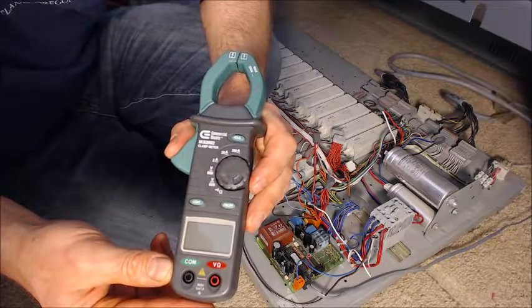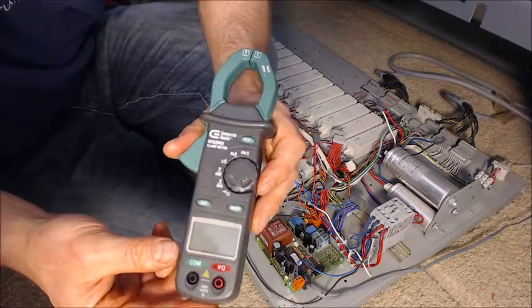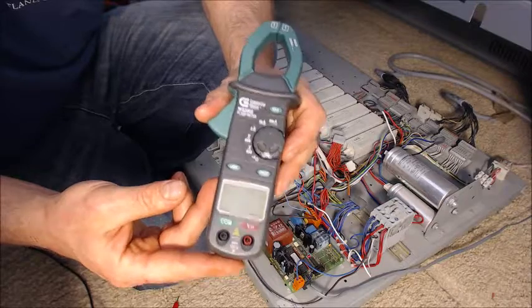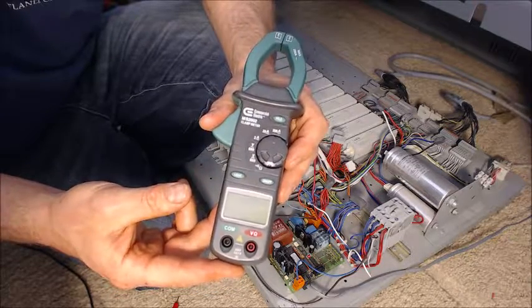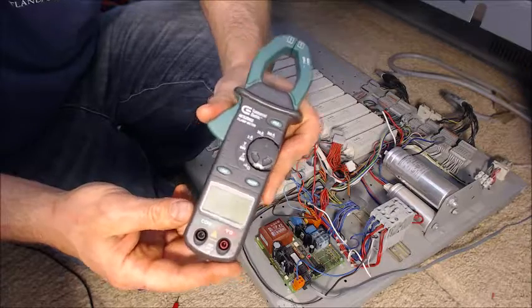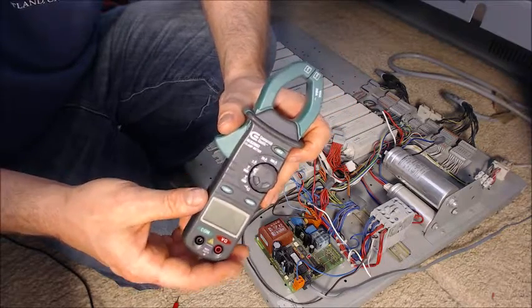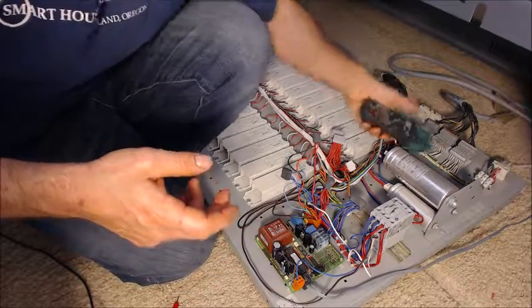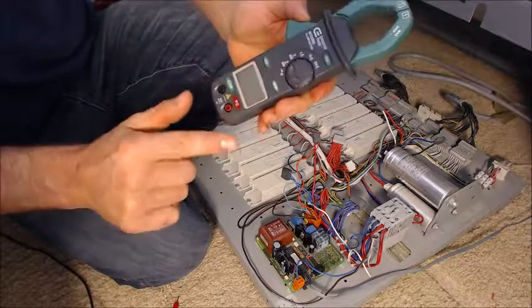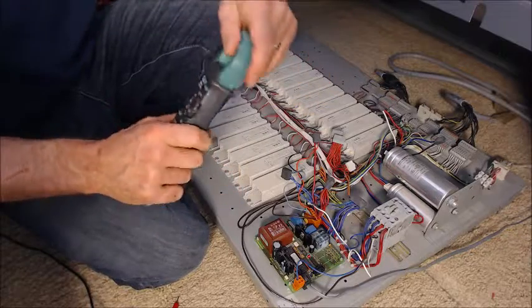What's interesting about the clamp meter is that we're able to measure current with it. The standard meter really can't do that, because you'd have to connect it in series with the load, which isn't practical given the very high loads on these appliances. With a clamp meter, you clamp the wire — a lead — inside the opening and you can measure how much current is on it. This is certainly what I recommend for current measurement. But let's get back to our voltage reading.